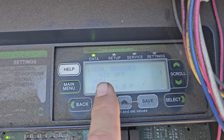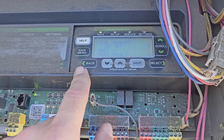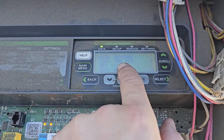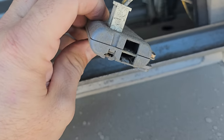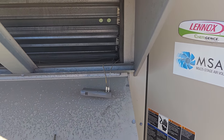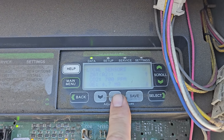The outside air sensor input shows a completely open sensor. That's my enthalpy sensor right there — actually, the outside air sensor is up in the front of the unit. It says OE — I believe that's outdoor enthalpy. I'm going to change that right there; I'm pretty sure it's bad. I can see corrosion inside the sensor, so we'll fix the wire connection and put a new sensor in too. Got a new enthalpy sensor right here. I verify that we're now getting an enthalpy reading — OE must mean outdoor enthalpy.